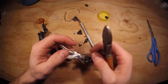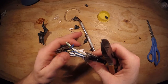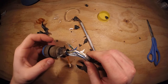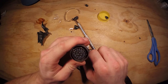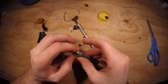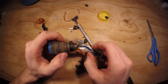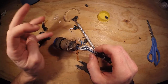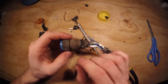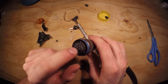I might have to have a play with that a little bit later on. It wasn't what I was expecting — I was half expecting to have some sort of coaxial line, but then this type of connector doesn't imply it would be coax; it would have to be straight lines. Although it might be twisted inside of here — that's definitely a possibility. What I'm going to do is pause and get a pair of channel locks and see if I can open this to get a better look at how the connector locks in, because there has to be a way of getting in here to actually solder to these connectors.